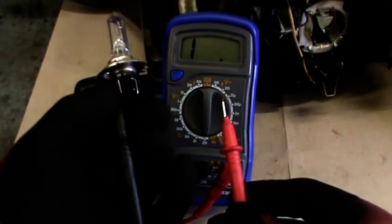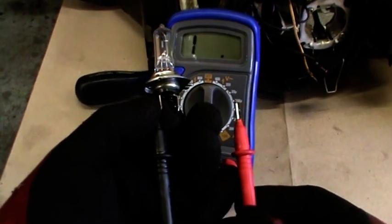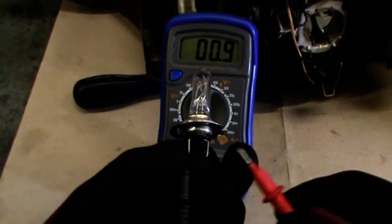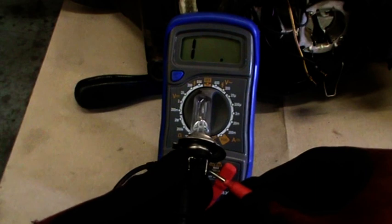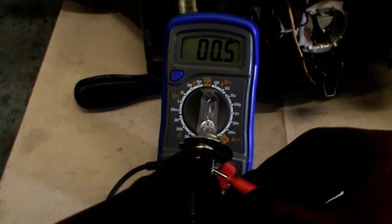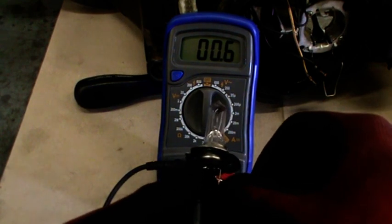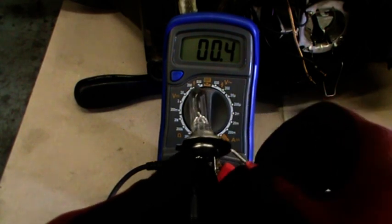Although the multimeter wires are coloured, and depending on what test you're doing it's important to put the black wire to the negative side and the red to the positive side, when you're doing continuity it really doesn't matter which way round you have them. I'm going to prove that - you can see the reading here. I'm going to turn the bulb around, put the black wire on the other terminal and the red on where the black was, and again you can see we've got the same reading. So for a simple continuity check on a bulb it doesn't matter which way round you're checking - unless it's an LED light-emitting diode bulb. But a normal incandescent halogen filament type bulb like this, you can test it in either direction.